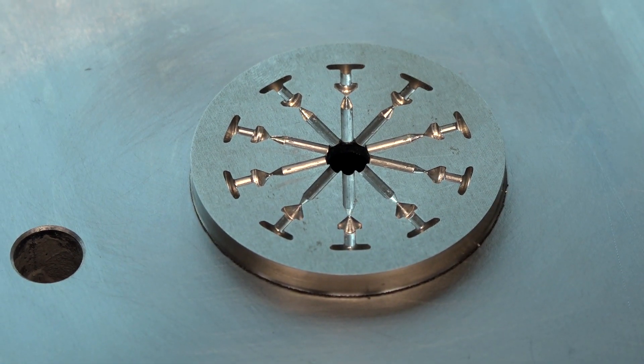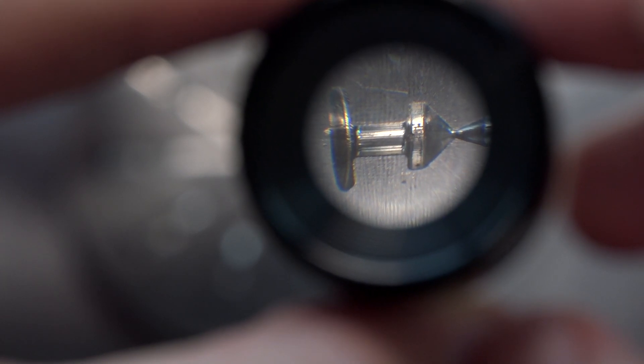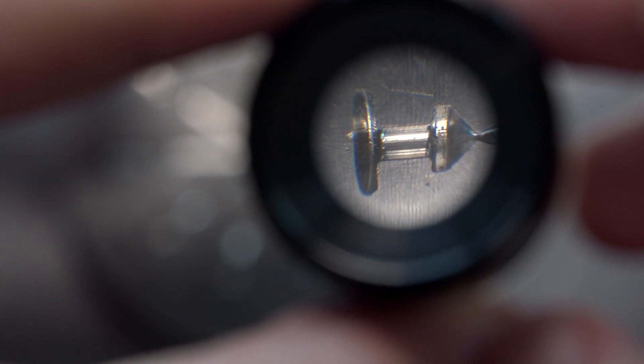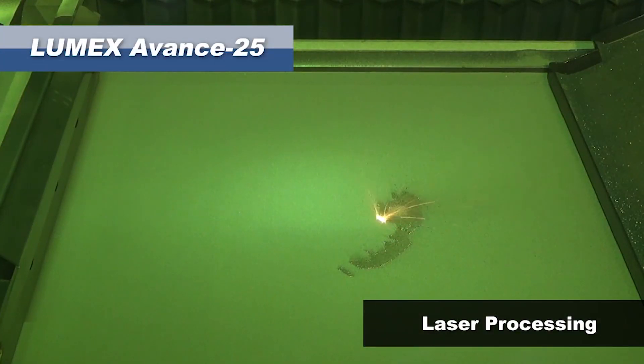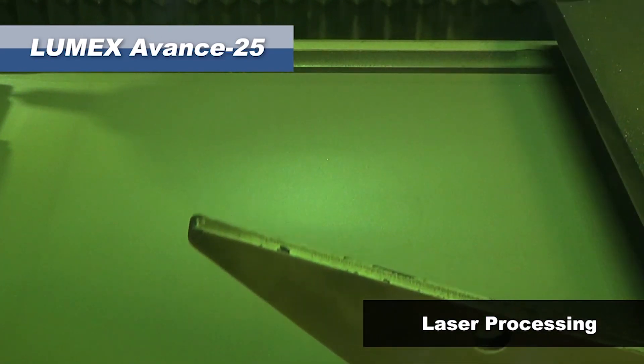That's one of the really big benefits of this technology. Waterways and cooling channels in mold tools are absolutely essential, and since the invention of 3D CAD you can get three-dimensional waterways. But a big problem up to now has been that sintered waterway channels have a very rough surface finish — they collect spores and bacteria and clog up. Now with this process, during the layer build we can machine those waterways to get a very smooth surface finish, which is absolutely fantastic and stops all the clogging problems.